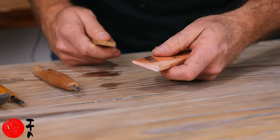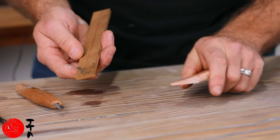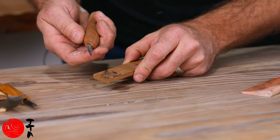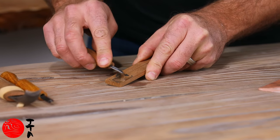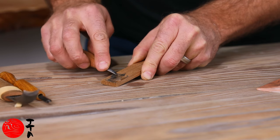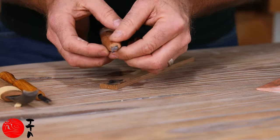What I like to do now with a lot of different stones is wipe the slurry off the stone onto a bit of timber. You can use this slurry — which is a mixture of the stone particles and also the metal filings — to just do a final part of the strop of your knife. This will be quite a bit finer than the actual stone itself, and you can see very quickly that we're getting a polish there.